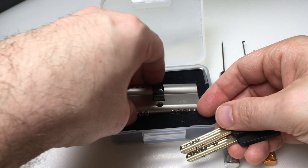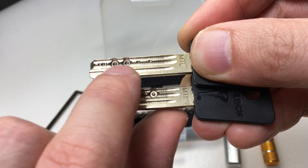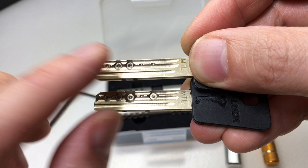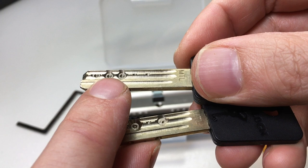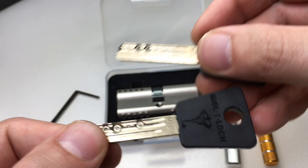If you look at these keys, you'll see some features I have to get past. You can see outer larger circles and inner little dots. The inner dots, or dimples, are actually for the inner pins — they're quite small, about a millimetre or slightly less in diameter. The outer pins are slightly wider, somewhere around three or four millimetres. Now this side is actually a lot easier to pick. If you look, the inner dimples are all lower than the outer edge. That means you only need to pick the outer edge and then just tickle the tops of these pins, and it opens. This is the side I'll be picking today.